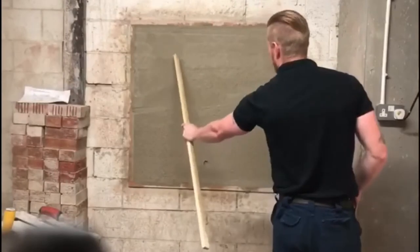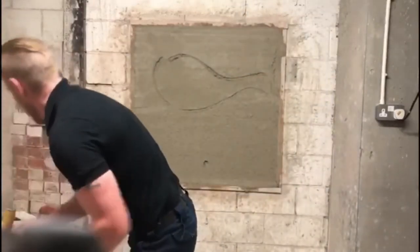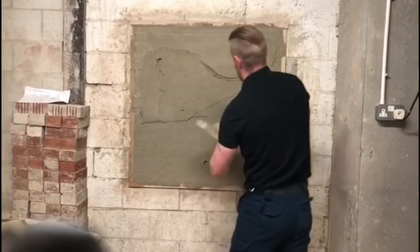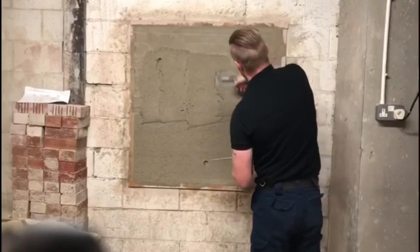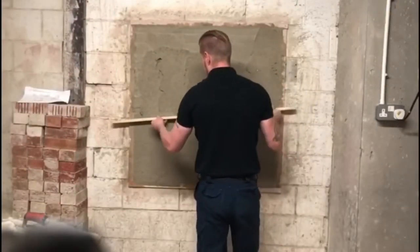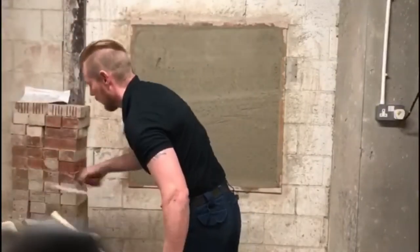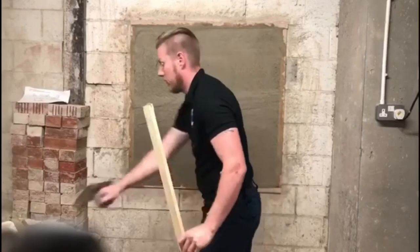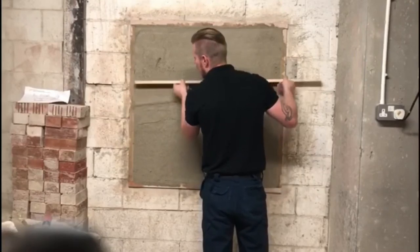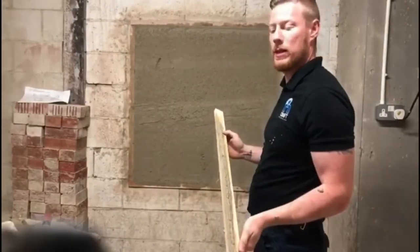As you can see in the mortar here, the hollow spot here, which then has to be filled out. I'm going to give it a nice wee lick, nothing too heavy. Okay, take off any excess on that wee slack there. Okay, nice run here now. We will then leave it for about 45 minutes for devil floating.